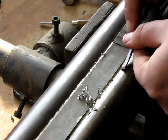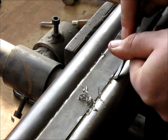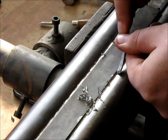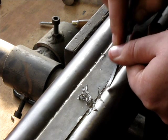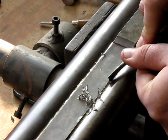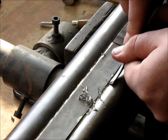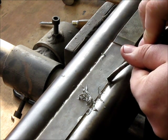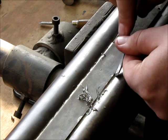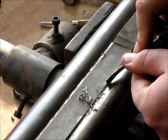And like I said, you start with these chisels and take the bulk of it up with the chisels, and then you move on to the rifflers. Because the chisels won't take you down to bare metal, so you use the fine point rifflers to get in there and file a bunch of it off. And then you come in with the dental pick to get down way in the bottom, or the handmade tools like my ones that I make out of drill rod, and you scrape the bottom edges out. And then everything after that is sanding it, and that just takes time, but you just use sandpaper going through your various grits, and you wrap it around your tools and get down in there and polish it all up.